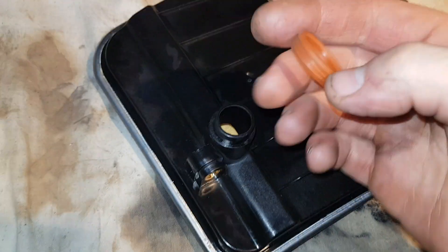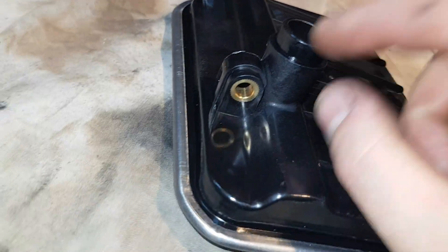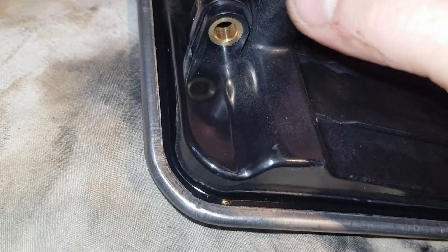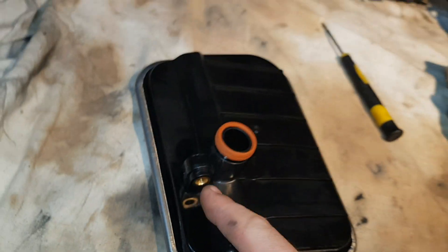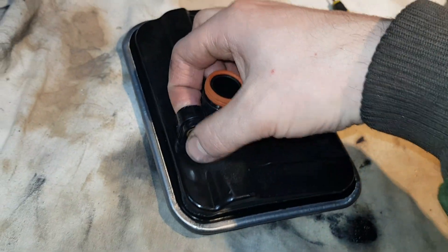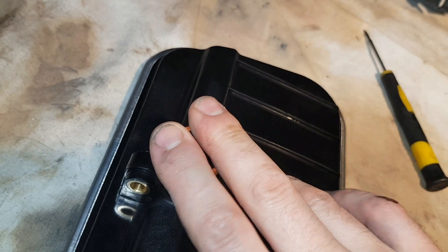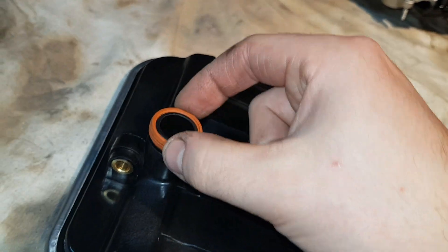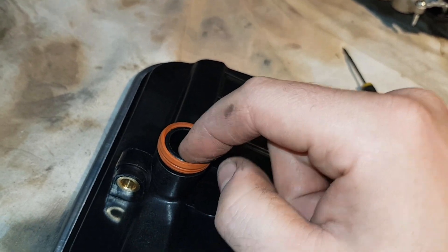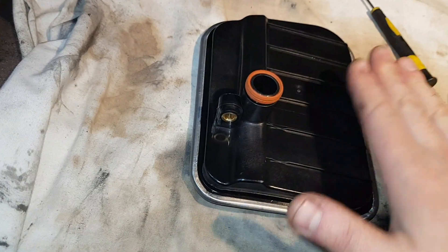I just want to grind this little lip slightly - ever so slightly, one mil maybe - so that I can just squeeze it hopefully without cracking or damaging it. It's secured with a bolt anyway, so it's not like it will matter too much. It's still in one place at one height, and the seal is there, so it should be all right. The seal is there only for the pump here - that's a bit higher - so it doesn't suck air from the surroundings but only sucks fluid through the filter. The filter is still in fluid anyway.